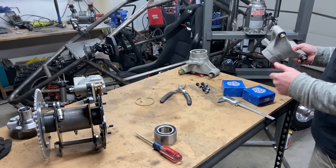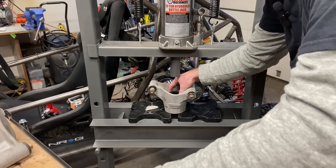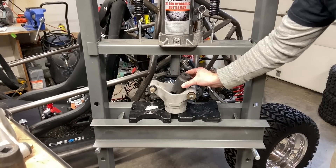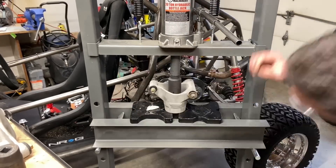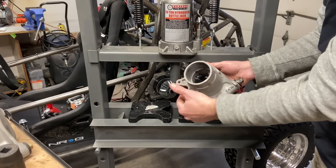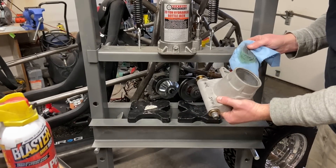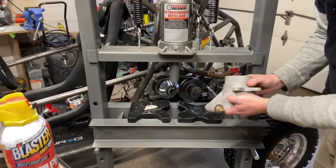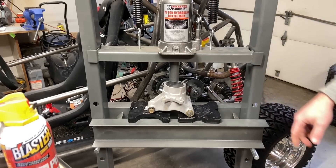The secret to pressing things isn't too cosmic - you want to get something flat or of similar shape to the bearing. Pressing out bearings isn't a big deal; they can separate all they want. When you press back in, you can just use the old bearing - sockets are my go-to for that. So we just press this old bearing out. Once it's out, give it a good cleaning; if there's rust in there, use a little sandpaper. Once it's clean, get it set up making sure it presses straight.